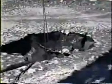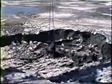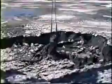There you go. The steepness of the crater walls indicates just how dry these solids are. This slurry is approximately 50 to 60% solids by weight. Crater 2 is successful, and now we're moving down to the driest area of the pond.